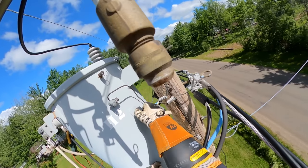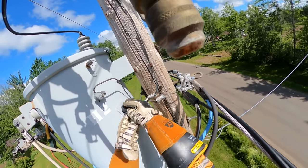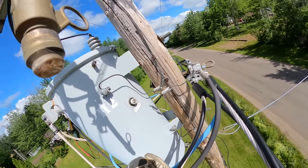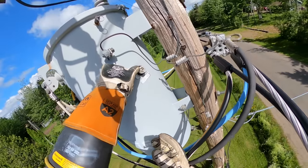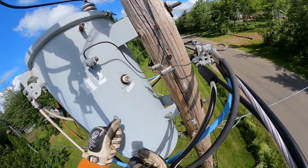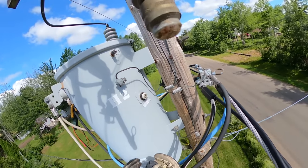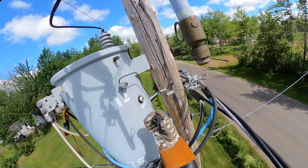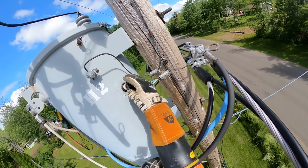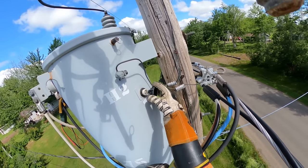Our label's pretty faded but you can see — remove the cover — and right now it's on tap three. There's five different taps. I can't see the diagram but I believe it's two and a half percent that it will change the voltage. So we take the back of the cap, take that arrow, and we're going to line it up properly.